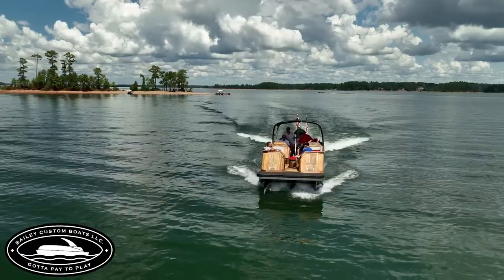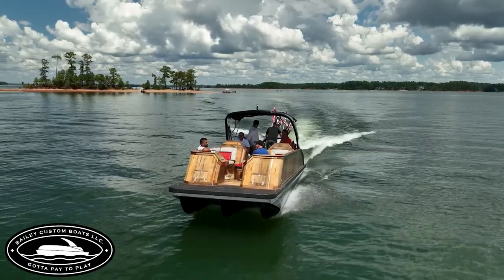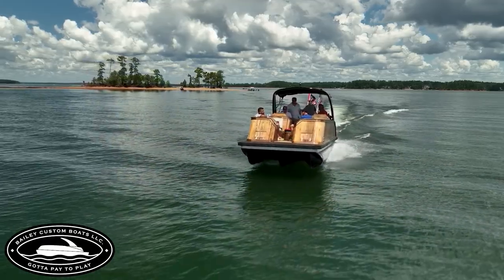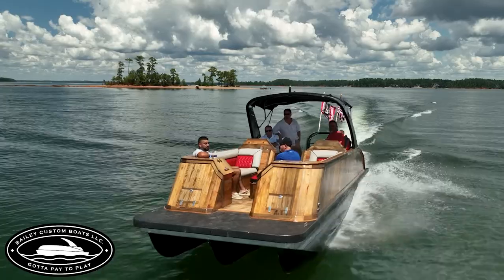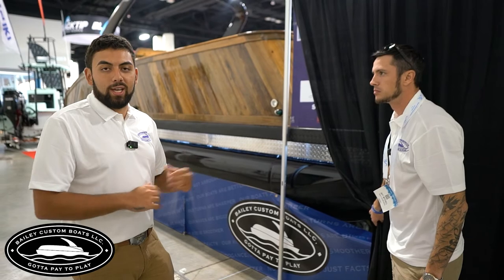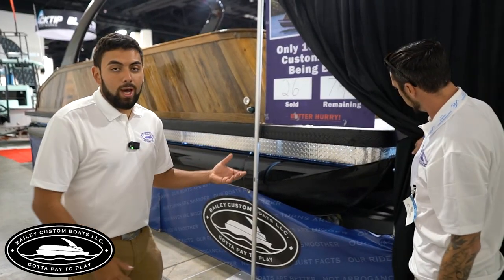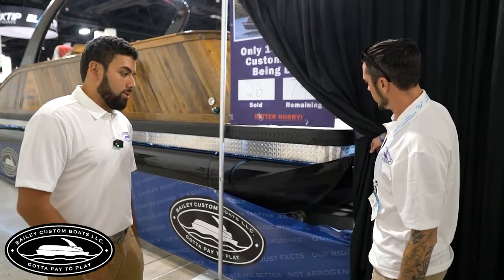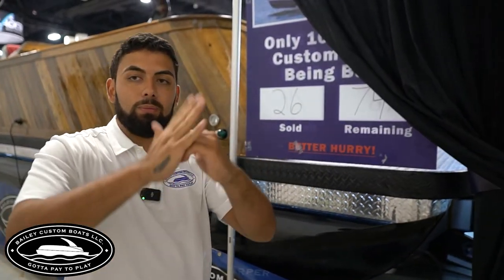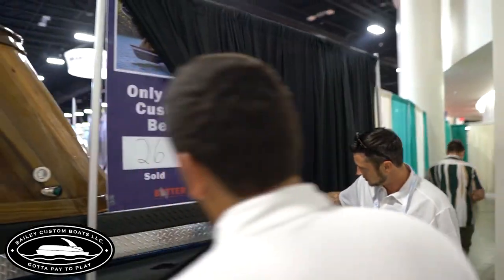You can actually take this one into the ocean — it's good for up to three or four foot waves. We do zinc plates on the bottom to help with salt water so they don't react with the aluminum. The dive plate on the front means that instead of going through waves like a regular pontoon, you pop up and go over them. So it's real safe — good for up to three or four foot waves.